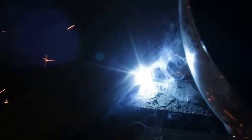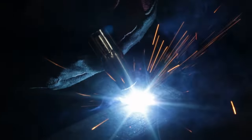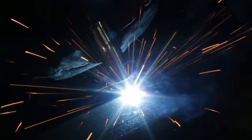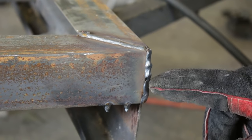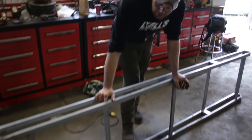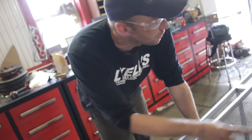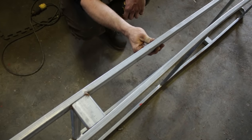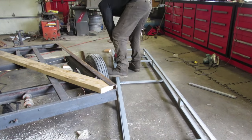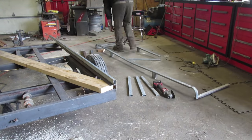I'm filling a gap here — trying to connect this little brace to this one just for the strength. You might recognize this — it's actually the skid that these workbenches came on, but it'll make a nice little railing all the way around the outside. Nice thinner steel, this is already galvanized. We'll clean that off and weld it solid because it's just tacked. Then build a nice little railing around it, then paint it, then install the wood, and then get on to our gate.